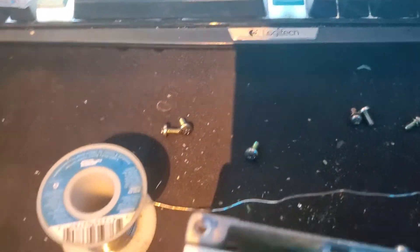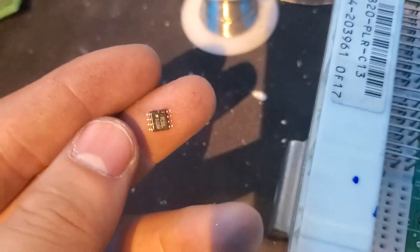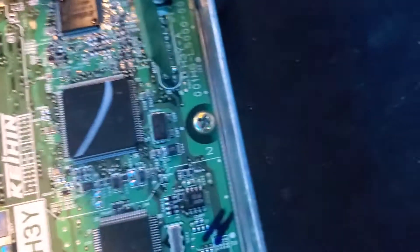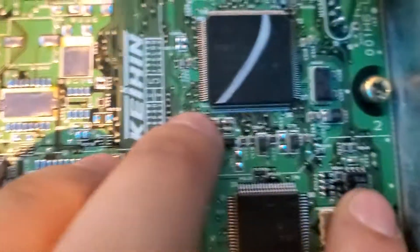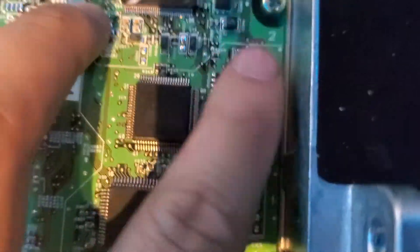You want to desolder these two chips right here. The first chip on the board, you'll see this small IC right here. This is off this board — I put in the one from my car into here, so you won't have to go to the dealership. It should be IC240, this is your EEPROM chip.